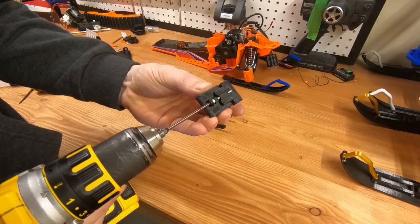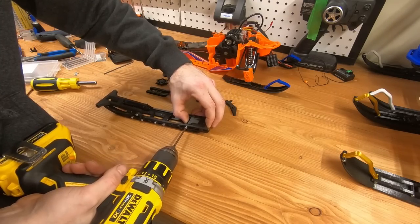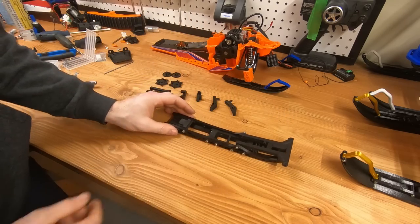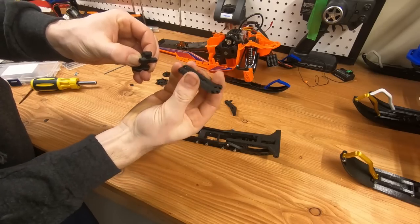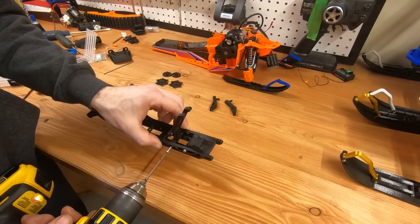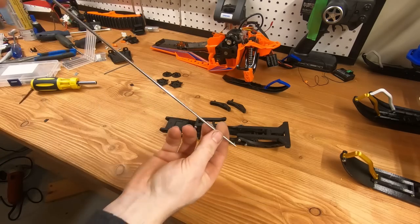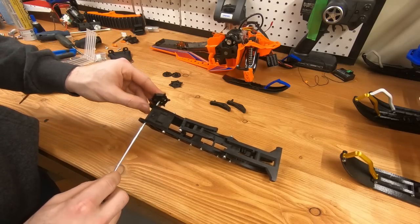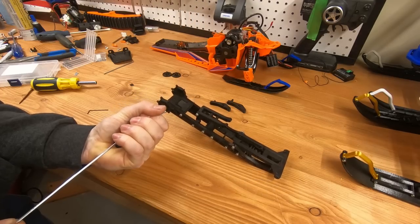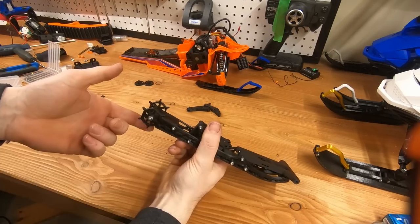I'm just heating up the little nubbin at the end so it's not coming out again. And just like that, you can screw and unscrew — simple as that. Everything should be loose around it, so make sure nothing binds and everything is very fluid, because it needs to move in the end. You'll also need to deburr the rod at the end to make sure the collar fits in — you need to take it off and grind it a little bit.